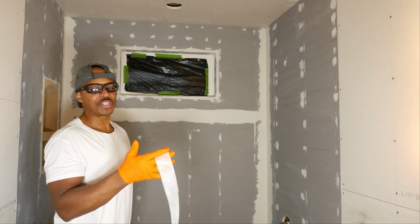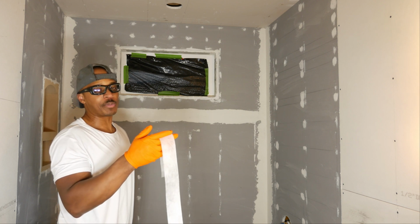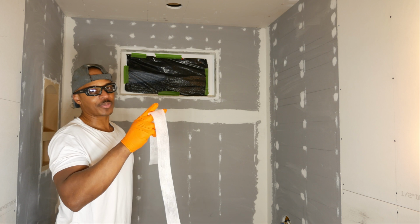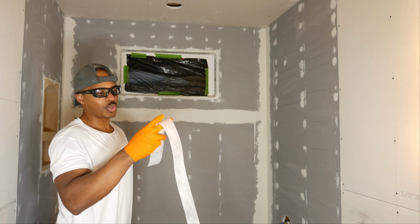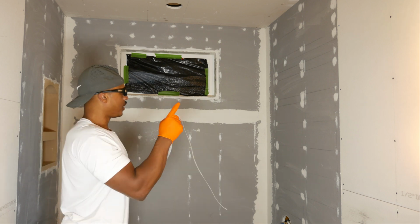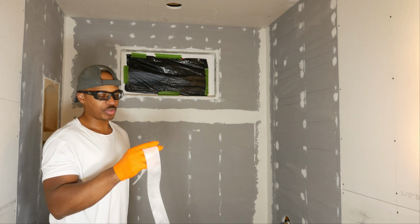So you probably saw I did a video on a bunch of tapes, and that included the Fiberfuse. And it looks a lot like this. I called their tech support to ask about Fiberfuse, and they told me that they did not feel confident recommending the Fiberfuse to be used with a liquid membrane. So I decided not to do that.